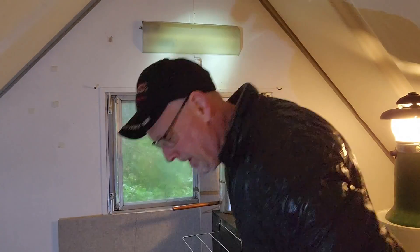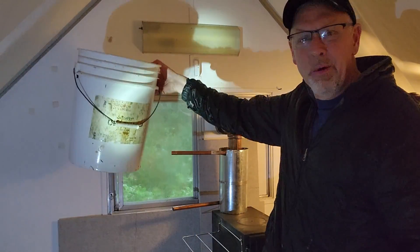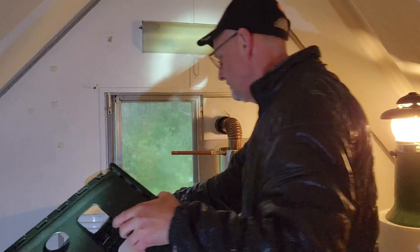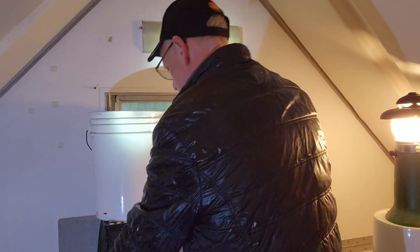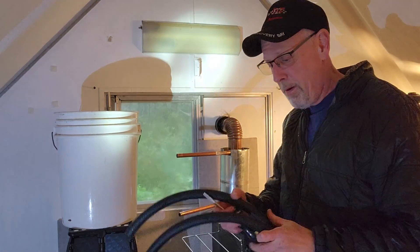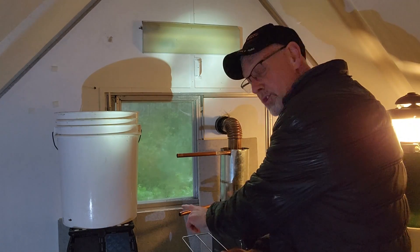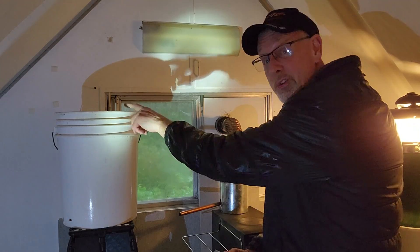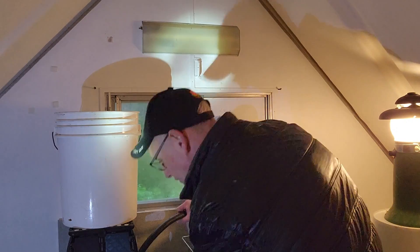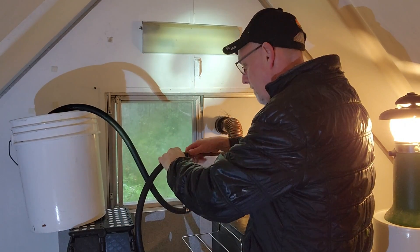Now we want the bucket. The bucket of water needs to be at least as high as the coil, and I think we can have it anywhere we'd like above the coil — just got to make sure it's at least as high. Now we're going to hook up the heater hose — this is good for about 300 degrees so it should be fine. We've got to make sure that the cold end, which is on the bottom, goes all the way to the bottom of the bucket, and we want the hot end to go to the top of the bucket to get the rotation of water through. We also want to ensure that the top of the hose remains submerged below the water level to capture any hot steam.